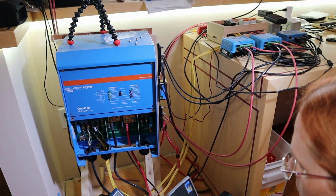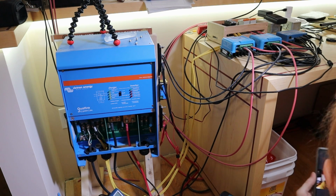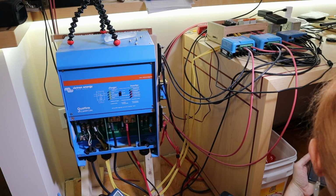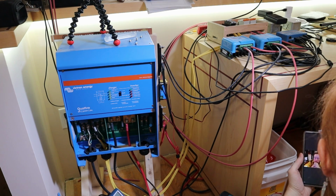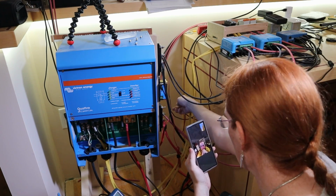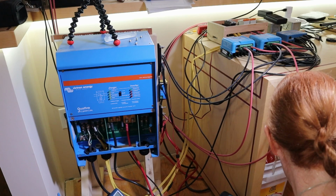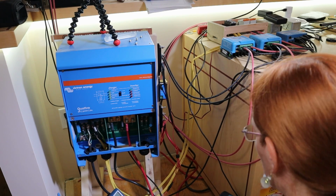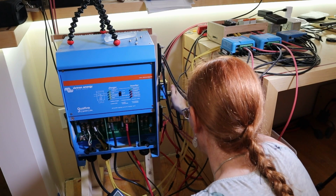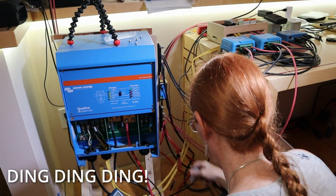Oh, I see. So did you break it? I don't know how I did, if I did. I mean, literally, I climbed under here, turned off the main disconnect of the old battery, ran the new wires. I pulled the SmartShunt out and put it in line with the negative out to the new battery bank. Oh, I forgot to put this in. Measuring resistance in a high power circuit is not always going to give you reasonable readings, because there could be enormous capacitors across there that take ages to charge up.